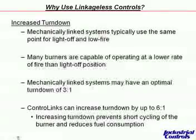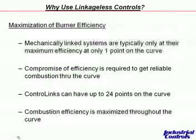We've had instances where the fuel-air ratio savings paled compared to the benefit from increased turn down — it was very beneficial for the customer. On boilers without characterizable trim on the fuel control, you're continuously playing with ball joints, adjusting the radius from a damper pin and where the push rod ends up, essentially changing the characterization of the linkage to match fuel and air.